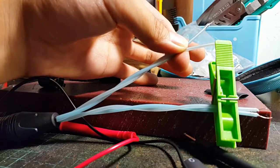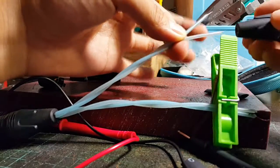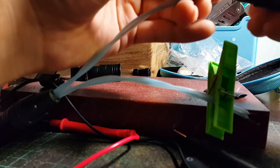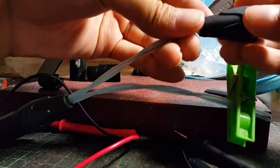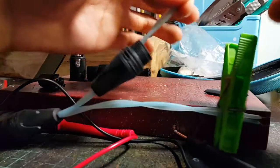The 4-pin side is finished. Before you start soldering the 3-pin XLR part, remember to separate the two connectors and slide all the shell parts onto the cable first, because you can't do that after soldering. I twisted the cables together — it looks better, but you don't really have to.